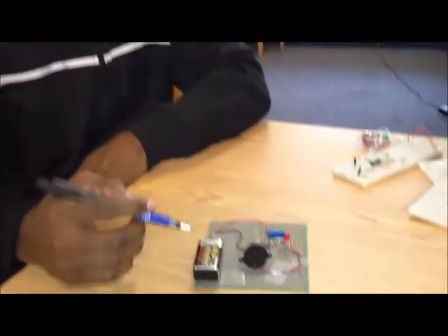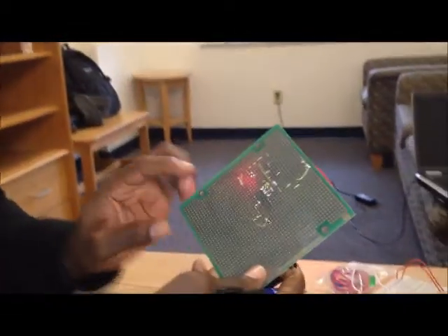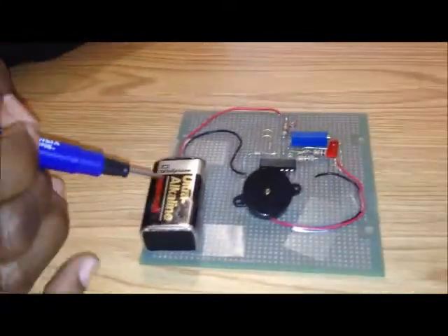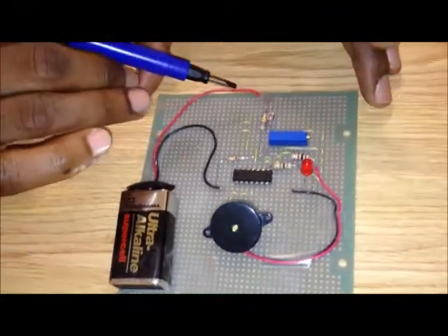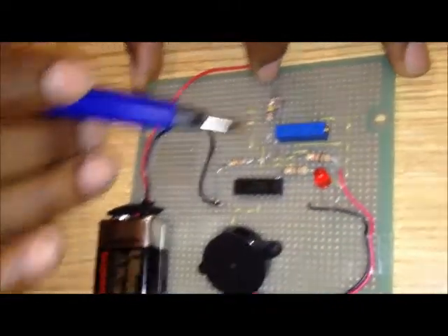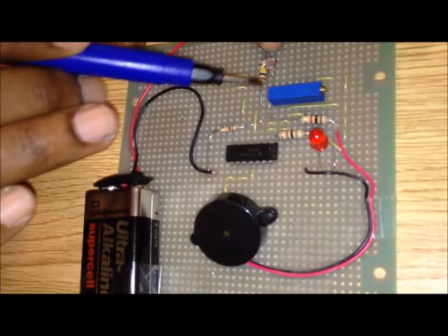This is the second part of our experiment, the Shadow Alarm. What we've done is we've actually soldered everything together on the back — all the soldering is taken care of and we put it together on a vector board. We have 9V as an input into the circuit, soldered together with the LDR or photoresistor, and the op-amp amplifies the resistance of the LDR.